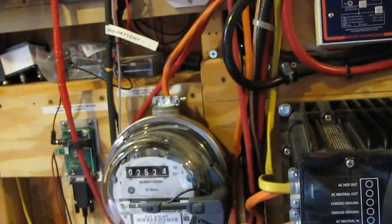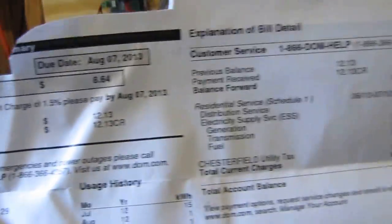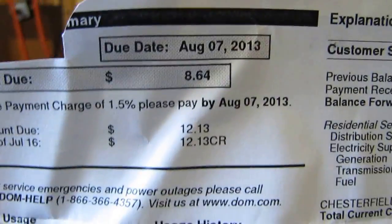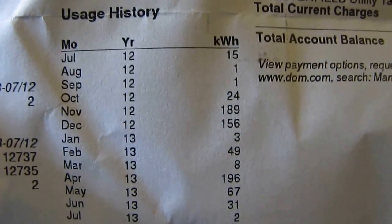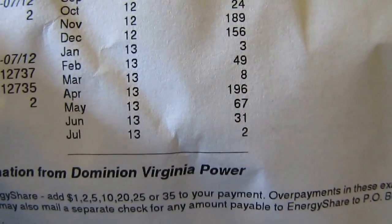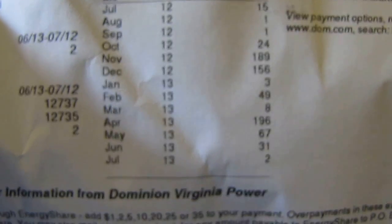Let me show you how good this past month was — for the month of July, proof is in the pudding: $8.64. Last month was $12.13. Last year in July I burned 15 kilowatt hours, but since then I added a total of 700 watts to my battery bank. This July I've only burned 2 kilowatt hours. So everything is working great — battery bank, wind, solar — and it's working a whole lot better since I got my batteries connected correctly.